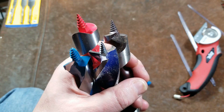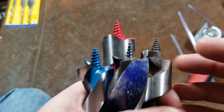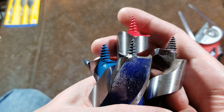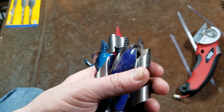I like the fly cutter on the other side of the Bauer — it provides a nice shaving action that helps improve finish on the back side of the hole. The DeWalt doesn't have this, and that thin section will get dulled the first time it hits a nail. On the screw thread tips, the Bauer has a very deep thread, and the Hercules has an extremely deep thread that should get great traction. The Hercules also has a beehive taper — an elliptical curve — rather than a straight taper like the others.